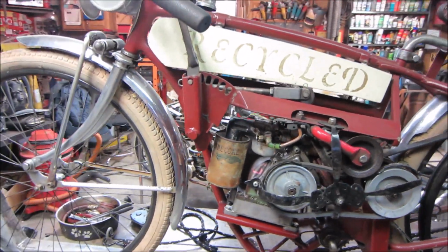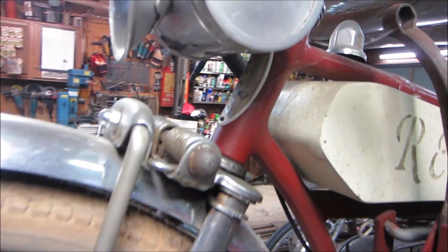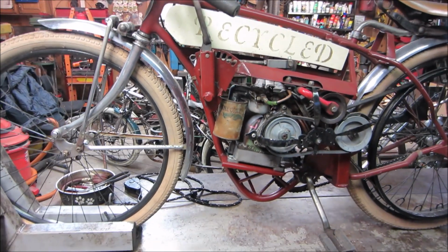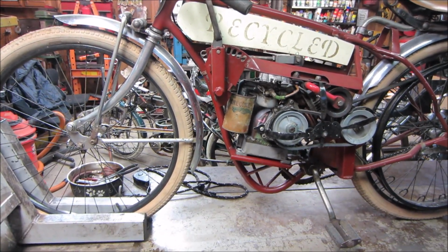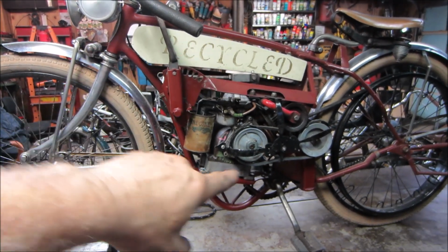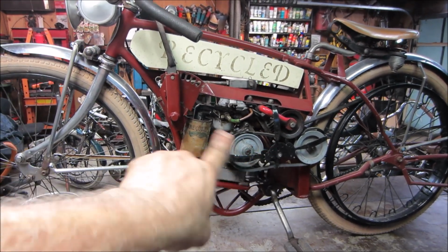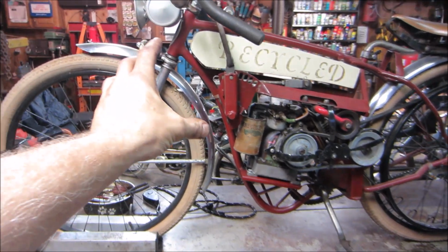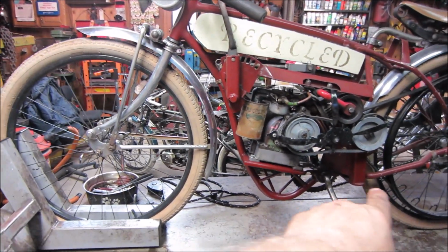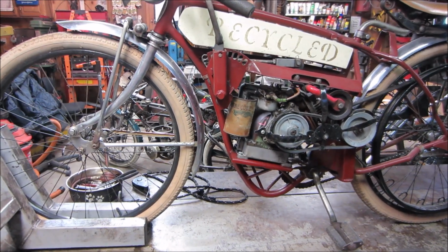It started out as a Schwinn, like a 59 Plain Jane Schwinn. The bike actually had a motor on the front of it when I got it, and I took that off and put it on something else. And I cut and lengthened the frame. I heated the frame up and stretched it to get more room in between the center, put a new tube in the bottom of it, and got the front tire raked out more. You know, get more space between the wheel wells.